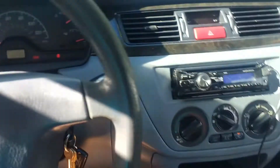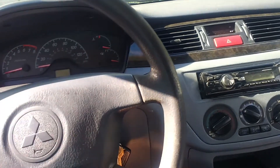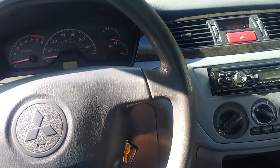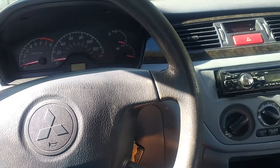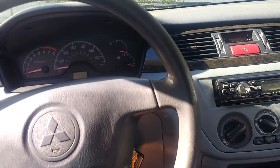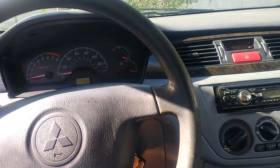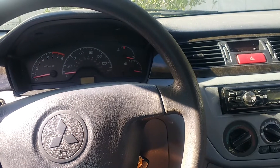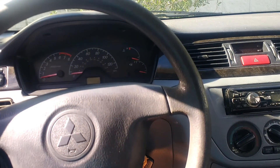What was that, an $11 fix? Not too bad at all. This was a known problem with these cars — Mitsubishis of this era, the fan controllers always had problems. I think there was a recall because of it, but this car's too old to go in for a recall anyway. If you're having problems with your Mitsubishi fan — if it's running all the time, or not running, or cutting in and out — it's probably the fan controller, but you can test it the way I showed you. It's a very super simple, cheap, easy fix. Thanks for watching.